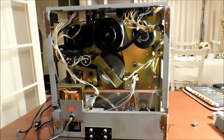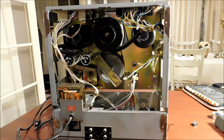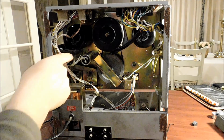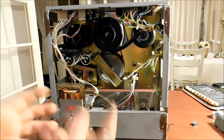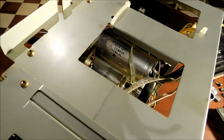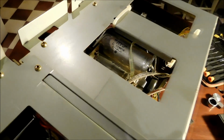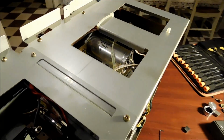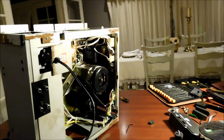And capacitors, electrolytic capacitors like these, are just two plates with a wire on each one and a dielectric between them, similar to a battery. And these electrolytic ones, the plates are very long and they're rolled up and put into a canister. And if you put them in with the polarity wrong, they can explode. But capacitors can be very small, nanofarads, picofarads, all sorts of things, but that's a big, nasty one. And so I'm not sure of its purpose. It might be harmless touching it, but I'm not going to.